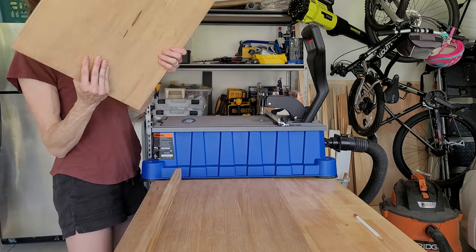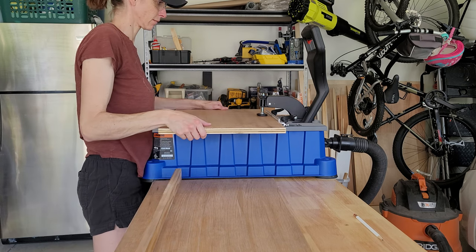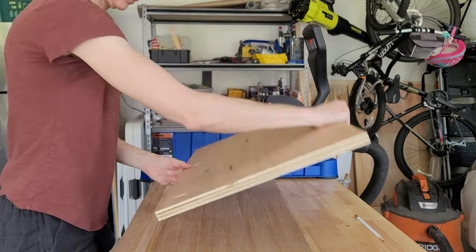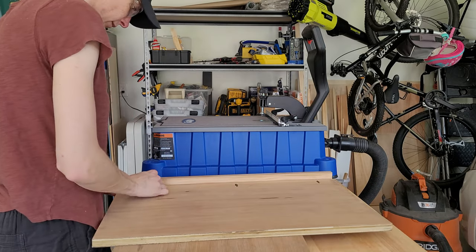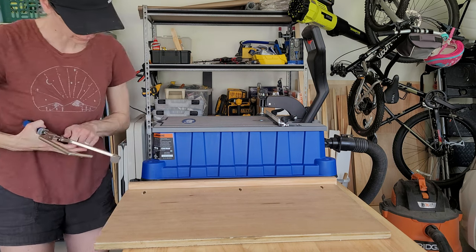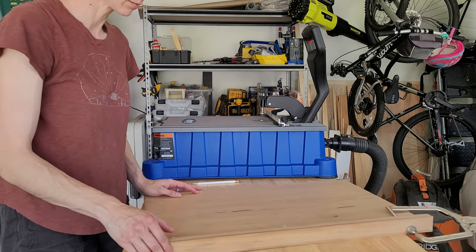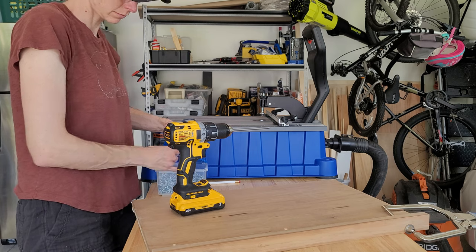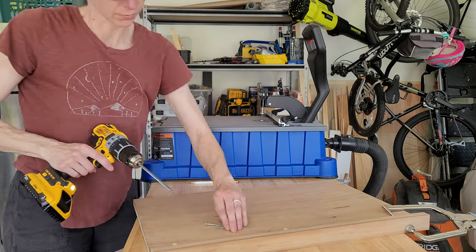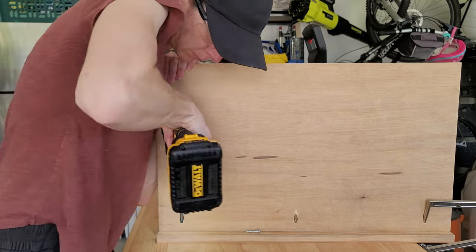With the face fronts on the cabinet I could measure and confirm my shelves would fit, and put the face fronts on the fixed shelves too. I decided to drill some pocket holes and have very secure face front boards on my fixed shelves. Those pocket holes could be seen from the underside, so I used the Kreg plugs — glued them in, shaved them off with a multi-tool, and added some stain so they blend in quite well. This face front board really adds a beautiful finish to the cabinetry. I could have left them off, but I wanted these fixed shelves to have that special decorative element.